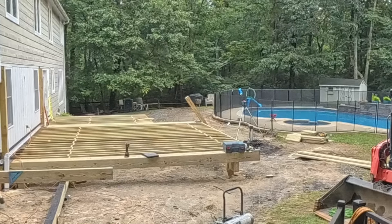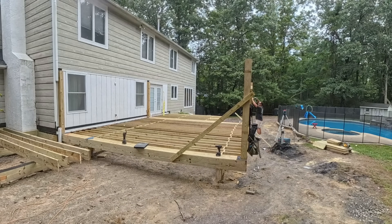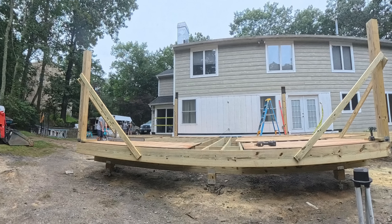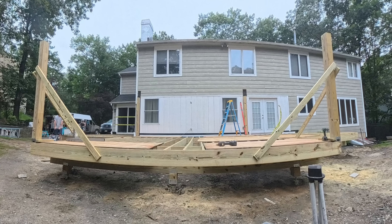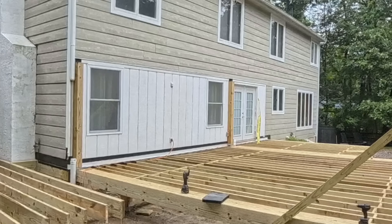We're going to have four posts — two at the house and two on the outside. Getting the posts installed is very simple. We're going to use a 6x6 base connector on top of our beam on the deck and then install that 6x6. They'll be by themselves at this point, so we need to brace them. We'll put a brace both ways on these posts to make sure they don't move and stay plumb as we take our measurements and install our beams. We're doing two posts at the house wall instead of pocketing them into the wall, which eliminates uncertainty about what's behind that wall and ensures the beam is fully supported.